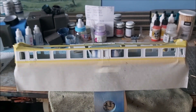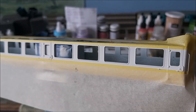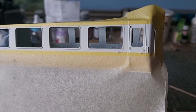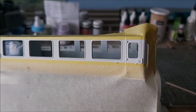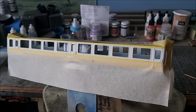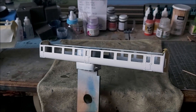Here's how the masking goes from start to finish. The top masking tape goes along the top of the windows, and the bottom of the blue goes through the door stops and the bottom of the hand grabs. There's one coach masked up now for the blue. I'll go ahead and mask the second one and then start spraying the blue.